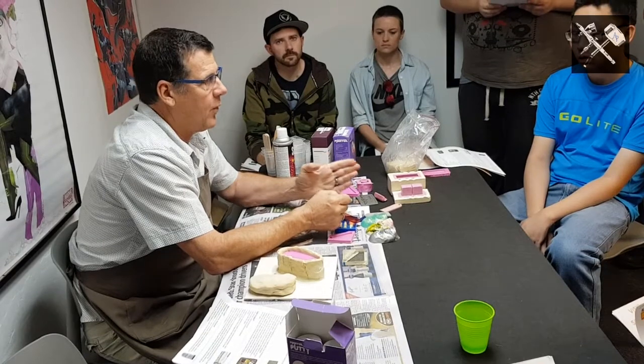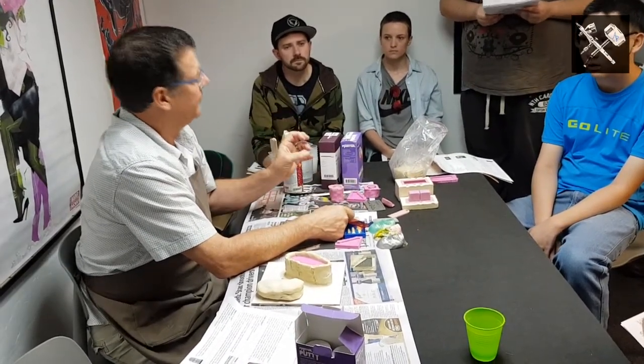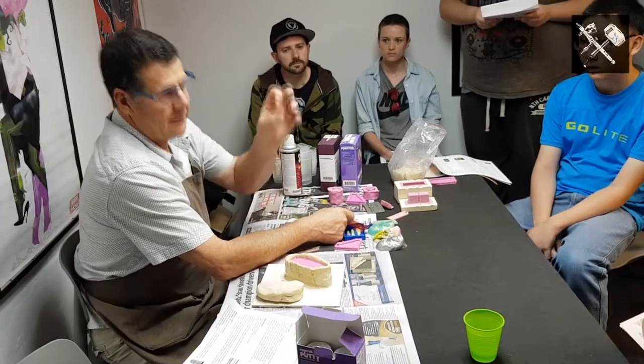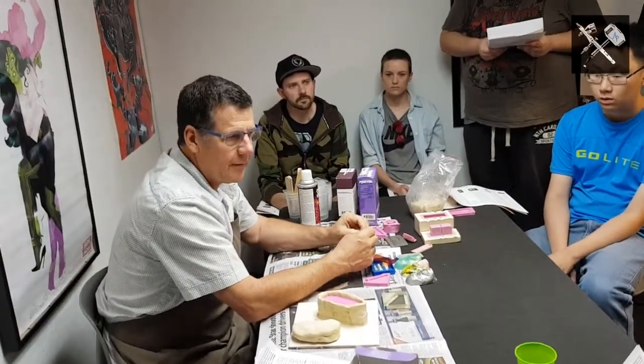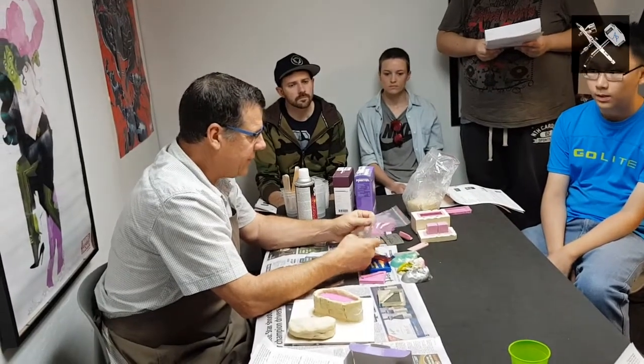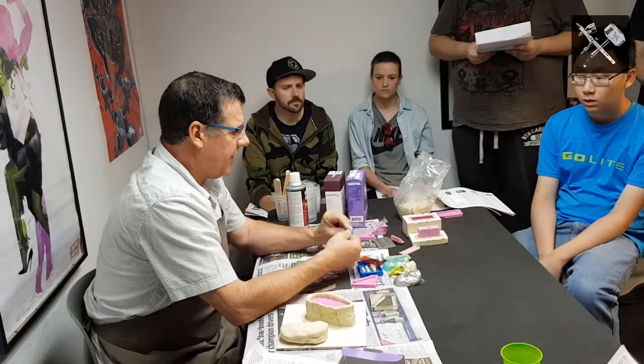Or, if you don't want to destroy your original part, take a mould off, reproduce your original, then cut and shut the duplicate. So you've still got your original to go back into your kit. Alright? So, lots of different opportunities, but that is called your master.